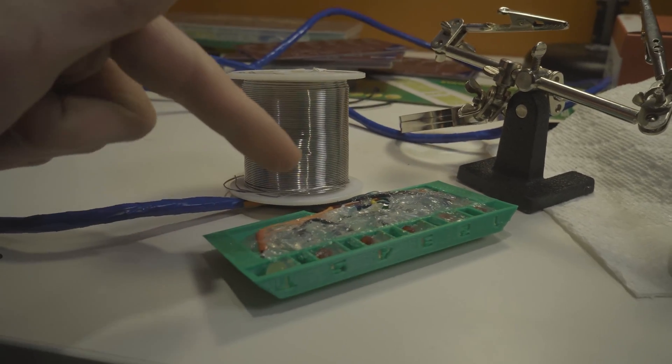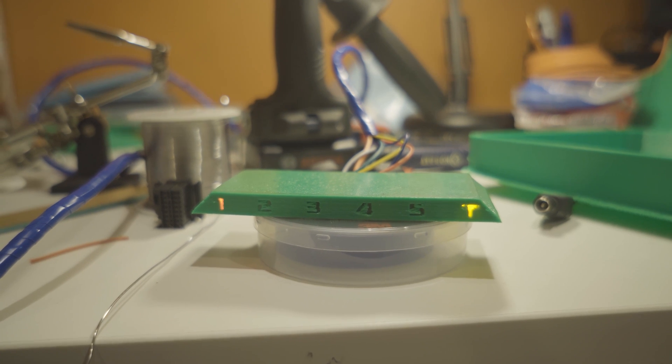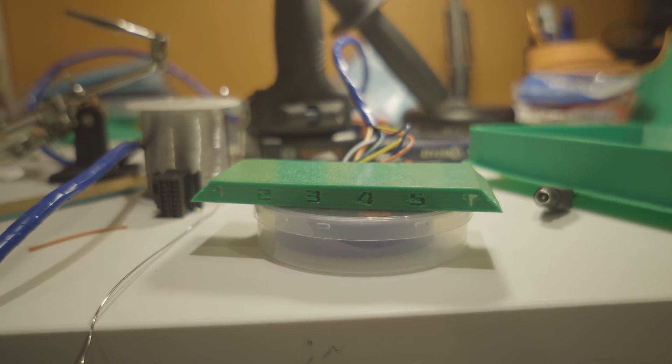On the gear indicator, I made sure the first gear and torque converter lockup LEDs were connected to the RX and TX pins of the Arduino, which allows it to essentially function as a diagnostic tool and see any activity going on while programming. To top it all off, I made it do a neat little animation whenever it finishes booting — partly as a diagnostic tool to confirm it has finished booting, but also just because it's cool as hell.